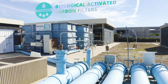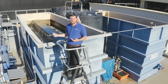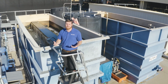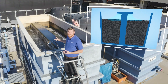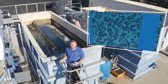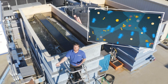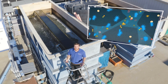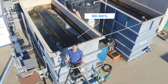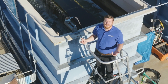The second step is the biological activated carbon filters. By the time the water reaches the filters, all the ozone will have either been consumed or broken down to O2, its more stable form. Inside the filters is a media teeming with beneficial bacteria. These bacteria consume the organics that were broken down by the ozone process, achieving about 30 to 50 percent removal of organic matter. The beneficial bacteria are then removed in the next step, along with anything else that gets through the filter.